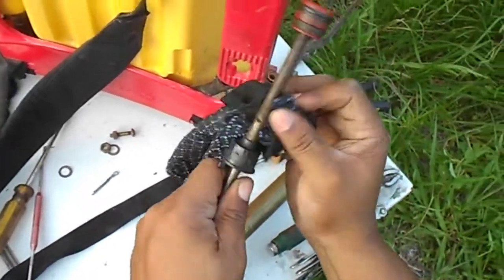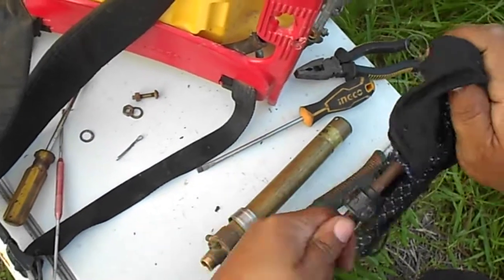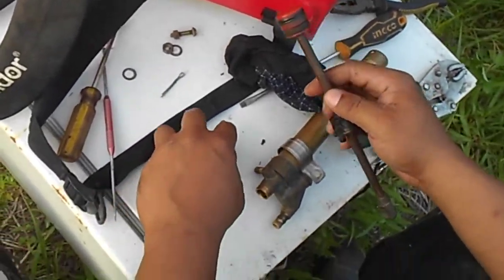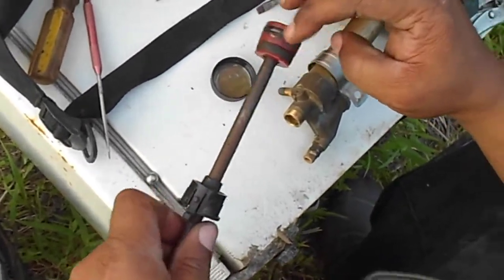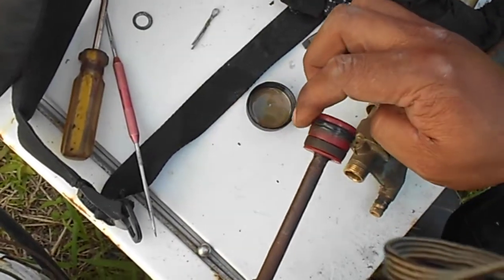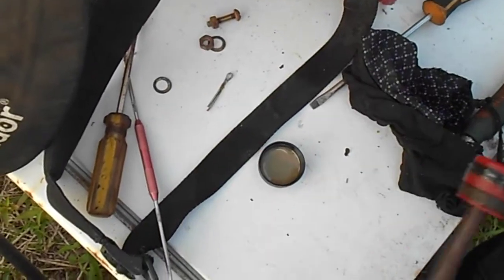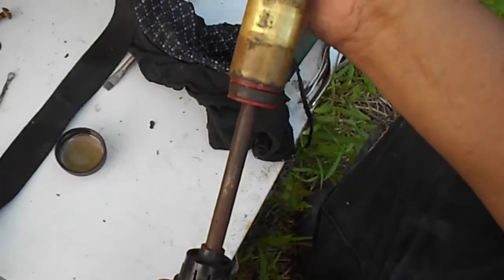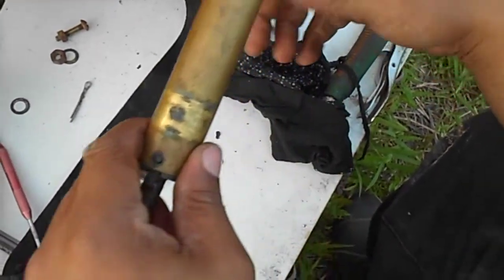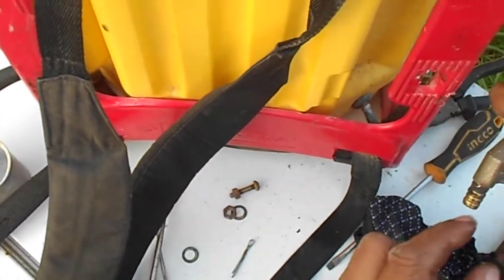Should have had some sandpaper to get the rust off the rod. A little lubrication here to get it back in the chamber properly. Any oil but cooking oil and brake fluid will do. Be careful not to pinch the edges on your o-ring — just wiggle gently and it will go in. Line back up the lock and press it. The hardest to come out will be the first one to go in.